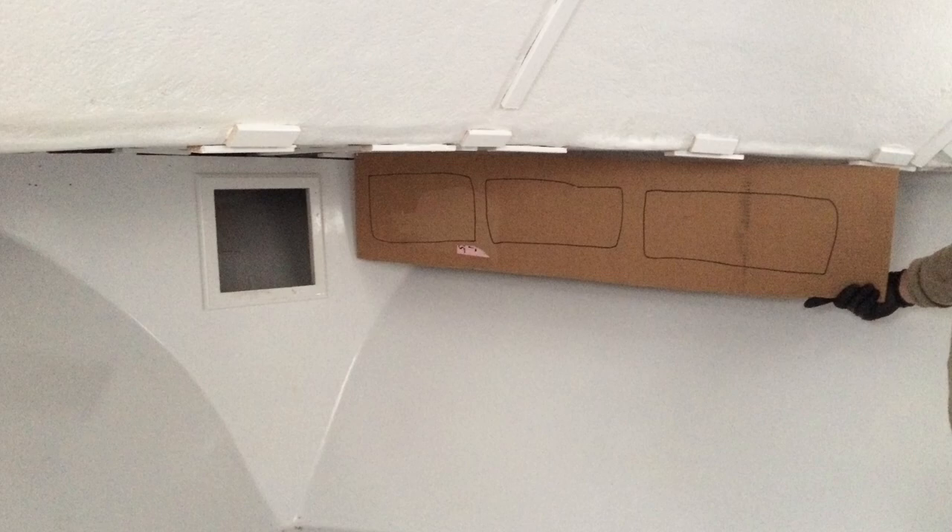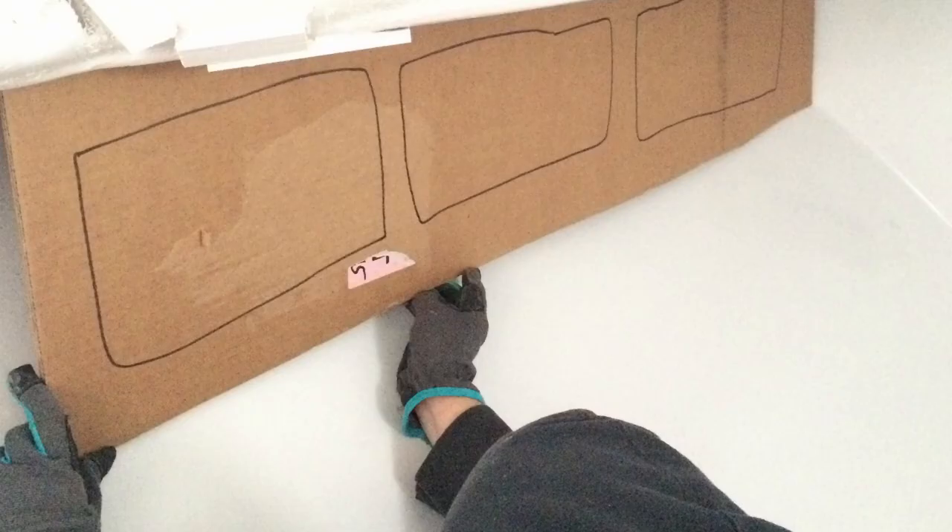This is about the simplest way you could make a set of cabinets for a V-berth. I always start with a pattern, and a cardboard pattern is the way to go. It gives you an idea of what the overall dimensions are, and it'll kind of help you get an idea how it's constructed and maybe attached to the boat. Once I have a cardboard pattern, I can take it, transfer it to the material I'm going to be making the cabinets out of, trace everything out, get some straight edges, and begin to figure out how to cut it.